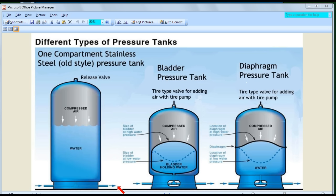Here's the way it works. Originally there's no water in the tank. Let's say you're working with a pressure between 20 and 40 pounds — your cut-on pressure is 20 and your cut-off pressure is 40. The water starts to flow into the tank as the pump turns on. As water goes in, the air trapped above the water starts to compress, so the pressure reading goes up, all the way to 40 psi, which is the cut-off pressure. At this point the pump stops and the air is trapped above the water, waiting to be used by the consumer.